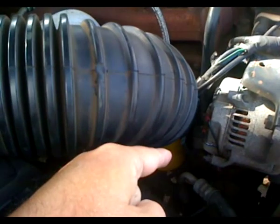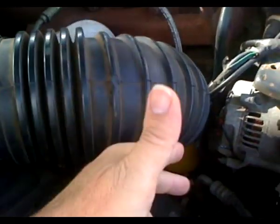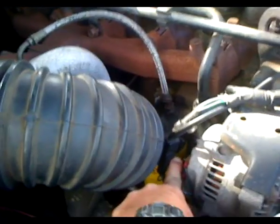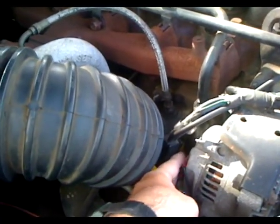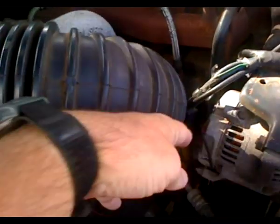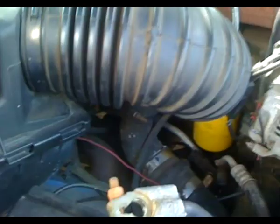A simple hookup I did on the side of the road: once I took the wires, crimped them, and put them on the terminals, make sure you tape up the square terminals from the back of the alternator field so they don't short. I used self-tapping bolts — that really helps. On the road I had to put the regulator behind the battery, but when I got home I redid everything. You can use a three-prong wire if you want. I ran the positive hot wire for the regulator underneath the stripping over there.